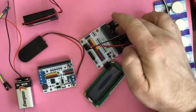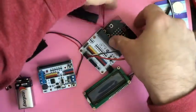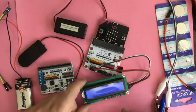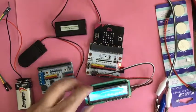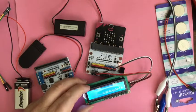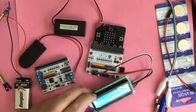You power this straight from the micro bit, so whatever power you have for your micro bit goes in. When I plug it in, you can see the board lit up a little bit but didn't really display, because this board is a 5 volt board — it needs 5 volts to actually work. 3 volt versions are hard to find. So that is the reason for having that 3 to 5 volt switch.